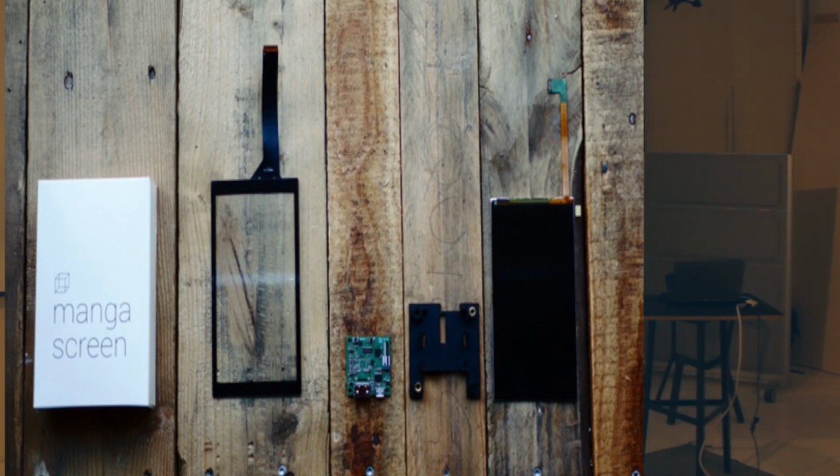This is the touch panel. So if you look at your cell phone screen, that is the same type of thing. That's what the cell phone manufacturers do as well. It's a capacitive touch panel. It doesn't really have any components on it, but it is custom made to fit on the screen, and it's custom made to have no distinguishing marks, and it's made to be symmetrical. So you can rotate it any way you want.